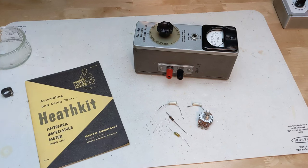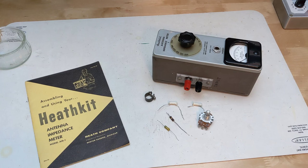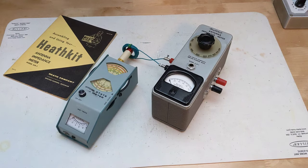The only other parts were two precision resistors, a germanium diode, two capacitors, and the meter. I decided to totally tear down the unit and rebuild it with new parts other than the meter and precision resistors. The control shaft extender was cracked and had a small clamp on it to make it tighter; I tried gluing the extender, which is made of wood, which seemed to work. The germanium diode was a CK705 type, which I replaced with a new 1N60. After rewiring, it worked.